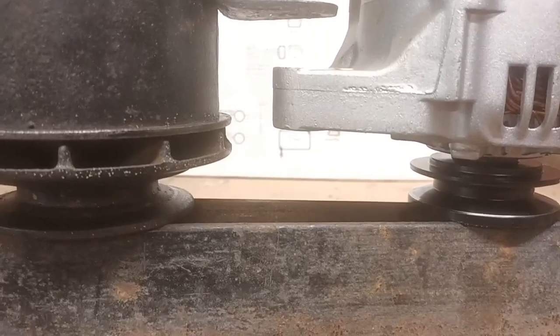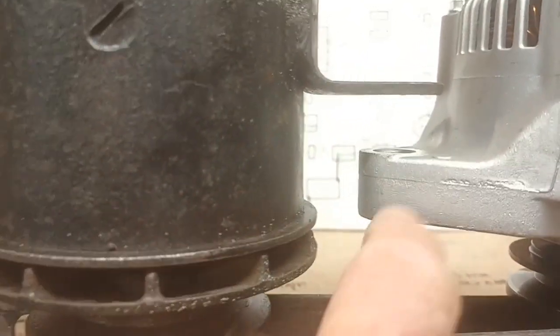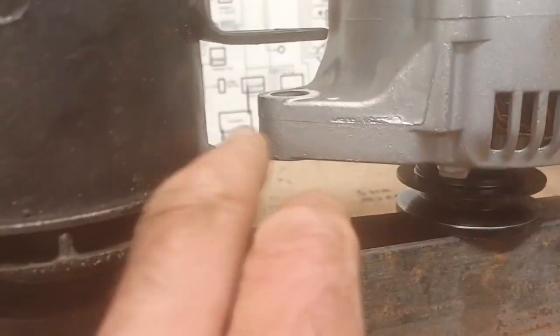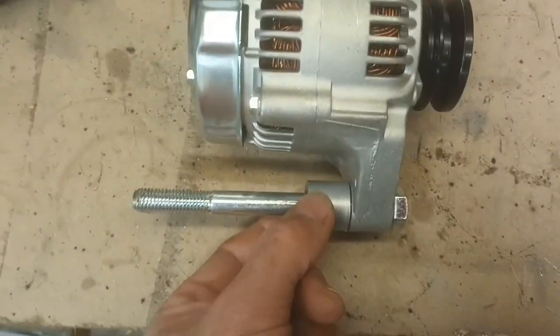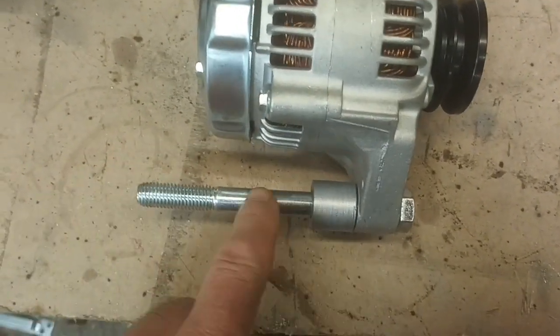I'm getting a couple of bits of angle iron so the pulleys are level, so I'm going to need to make a spacer to go in here, and a special bolt because this is 10 mil at one end although it's bigger at the other end, and the holes are 12 mil, so I shall make a special bolt to go in there. Here's where we are: made a spacer, got a new bolt, and this is 130 millimeters - might be a little bit too long, but you'll see.